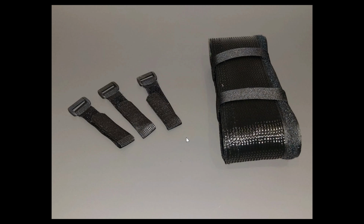It is important to fix the cables to the tripod because when the scanner is ready to be used and calibrated, if we move the cables because we move the scanner around the object that we are scanning, we can create very, very small movements of the components, but they are enough to break the calibration. So then we are not scanning in a good way.